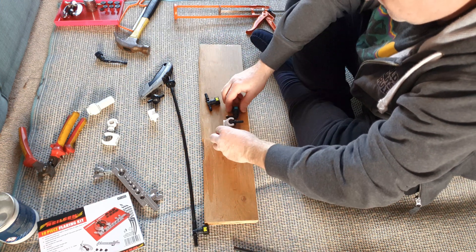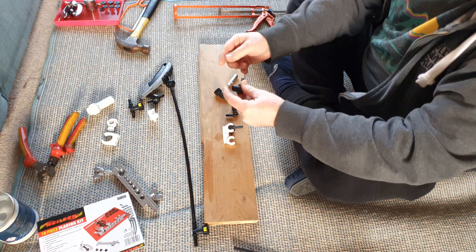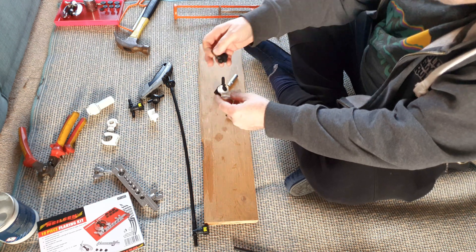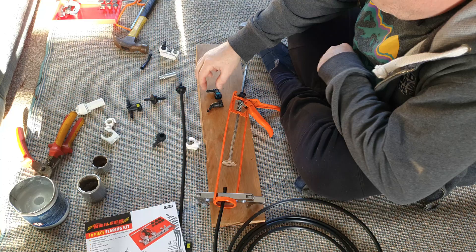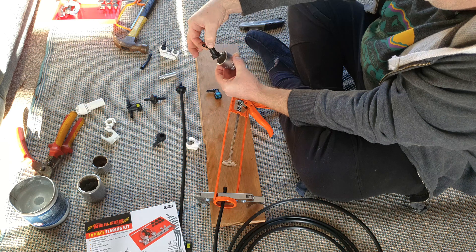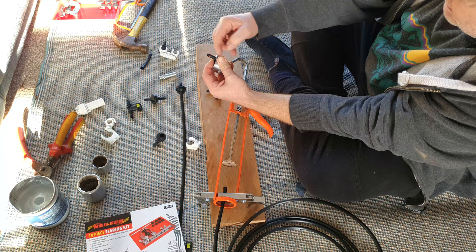Things become a little more difficult when you want to do angle fittings, whether they're 45 or 90 degree. This is a simple angle fitting that's going to push-fit into the rubber grommet in my brake booster, but I need to connect the pipe to the end of it. For this ID6 barb size, it just so happens that the fitting clips nicely into a 15mm copper pipe clip. For 45 and 90 degree angle fittings, I found sockets to be a good holder. For the 45 degree, I used a 32mm socket — put the fitting down into the socket at an angle against one of the flats, with the barbed portion parallel to the socket and straight.